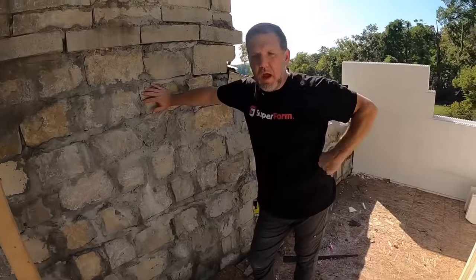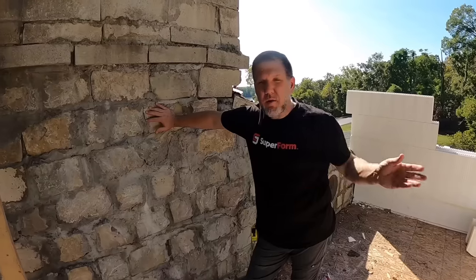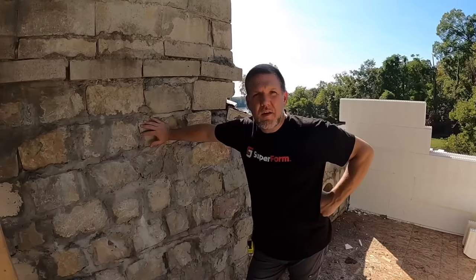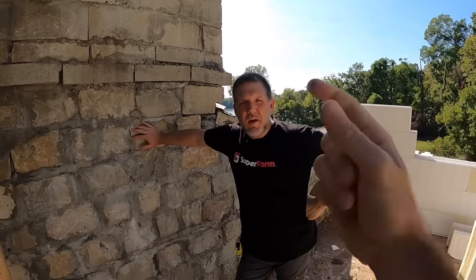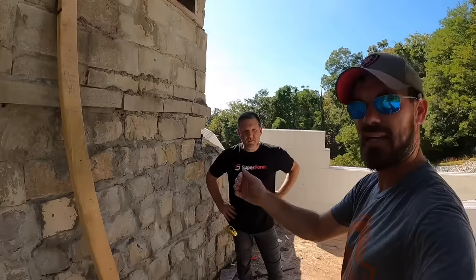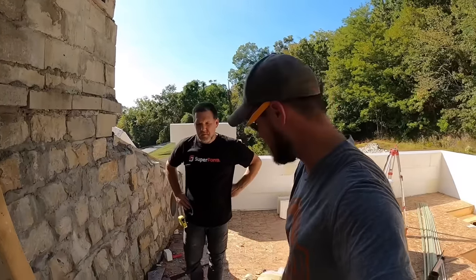Yep. And you could absolutely shoot it on with a power nailer too. Trim nailer is fine. A lot of guys are using DeWalt roofing nail guns with an attachment that goes in the groove opposite the one you're going to nail in, and it lines you up perfectly, and you can set your depth, and as long as you use the coils that have the three or four ring shanks on them, you're good. So you're right, you can just shoot them right in there. It just all comes down to the depth setting on your nailer at that point in time.